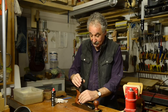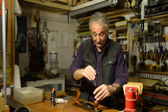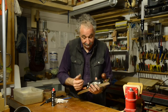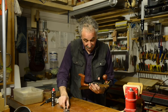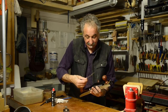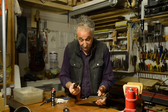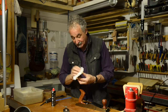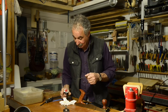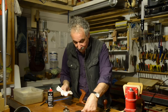Fresh out of the box, we've just cleaned the salt off, and now it's a good idea to check the screws with a screwdriver — the right size for the slot, of course — just to make sure they're nice and firm. Give them a little tighten. Then we're going to loosen off the lever cap, pop the blade out. Here is the blade — a very solid, chunky blade. There's a fair bit of machine oil here, so we'll clean that up with some paper towel and a little bit of lighter fluid to remove the oil.